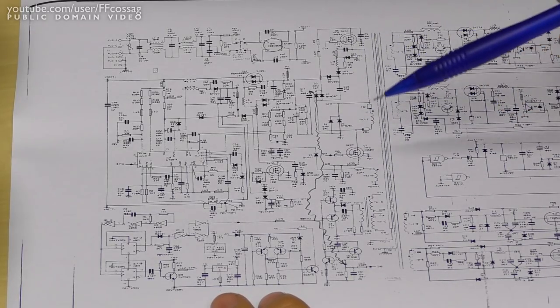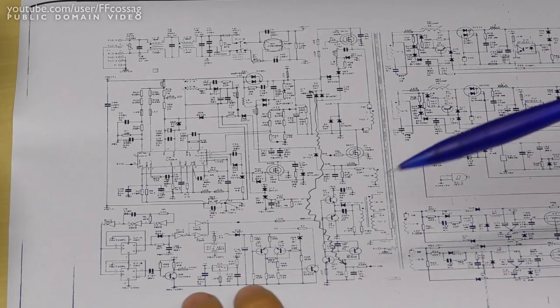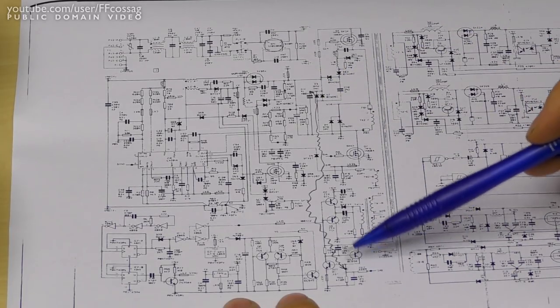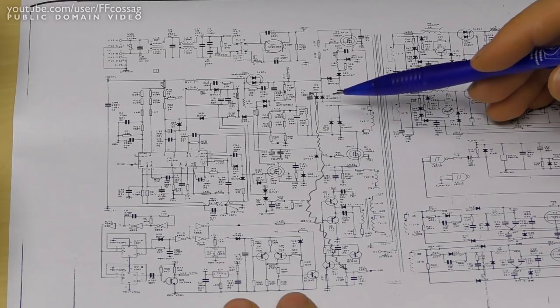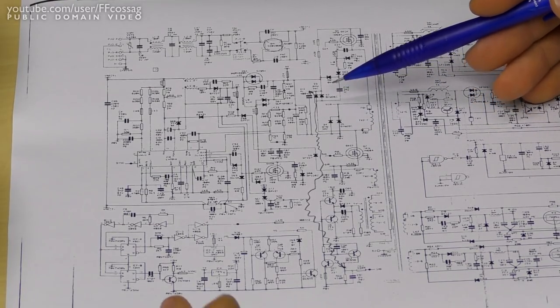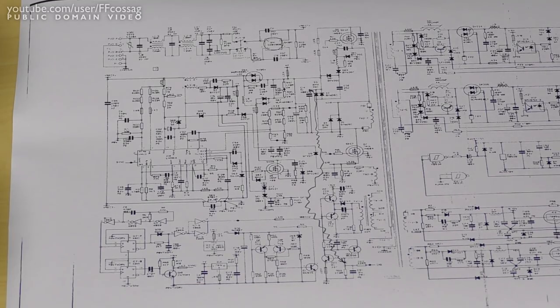So sadly, it's a bit tricky to read the schematic and look at this PCB, since the schematic and the PCB in this particular product don't align at all. I mean, these two points are 2 millimeters from each other in the real world, so it's going to take a while to figure out what's actually gone wrong. But reading through some of the application notes for this circuit, thankfully this thing is incredibly well documented, and I cannot stress enough how happy I am to have a service manual for it, else I'd just be entirely lost going component level all the way.